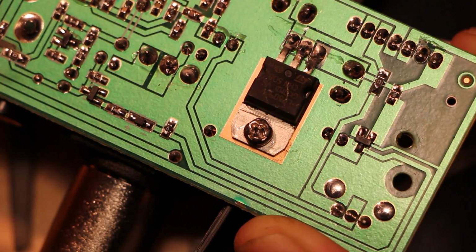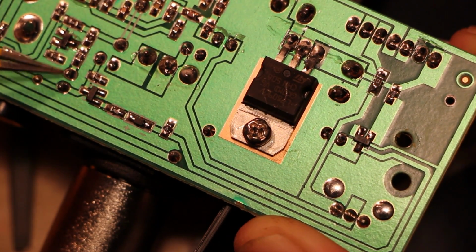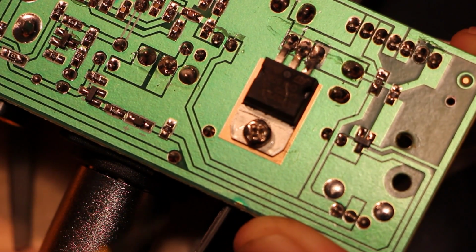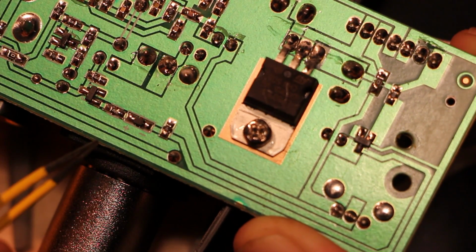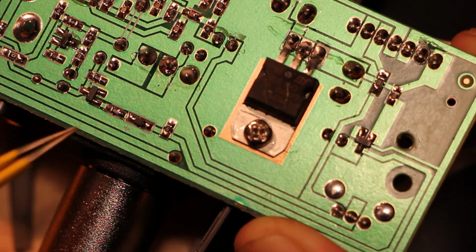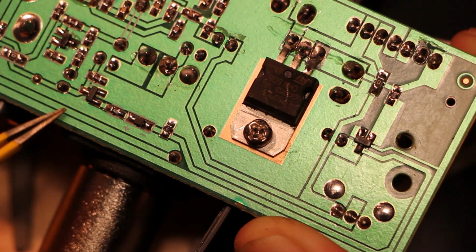The actual signal seems to be coming in AC coupled again right there from this amplifier thing, presumably. This circuit, I suspect, is some kind of power-on related mute circuit, so that either while this is off or while this is in the process of turning on, it mutes the output by just clamping it directly to ground with a transistor here.